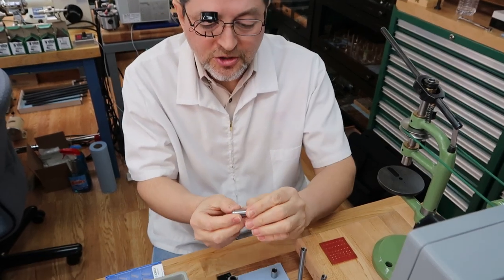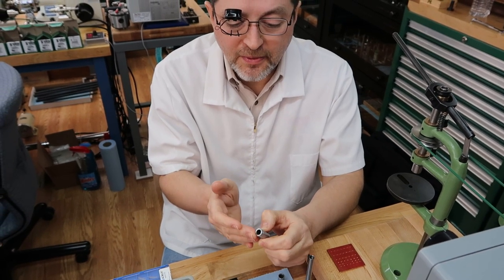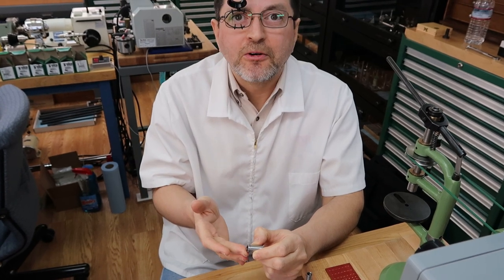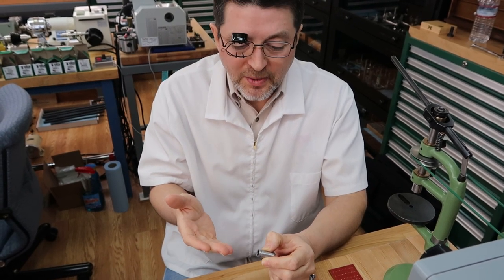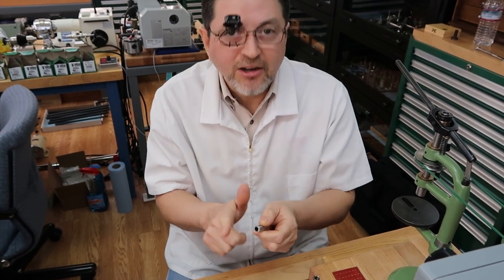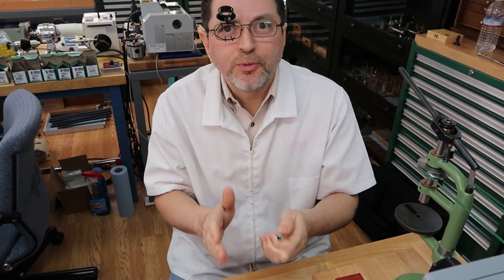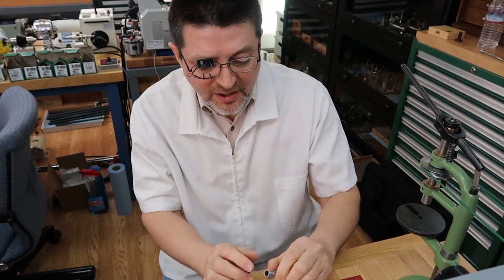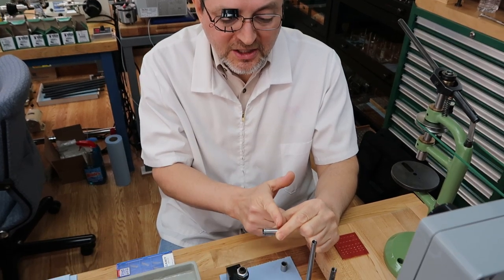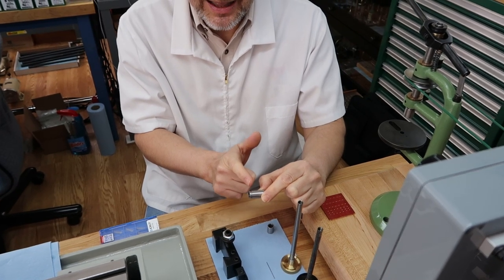So I took this tube, I'll call it a spacer, out to the machine shop. I had assumed they left it a soft material only because it's intended to be machined. But I did a file test to check the hardness, and I was really surprised. It was super hard. So I said, okay, before I cut it off to the dimension I need, let me do a little test at the end. And I'm so glad I did that.